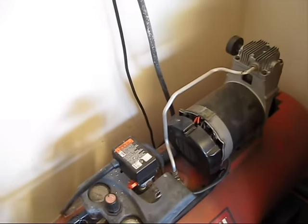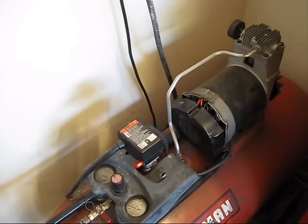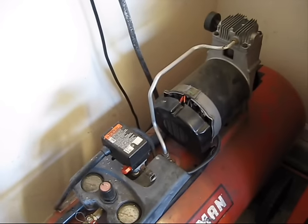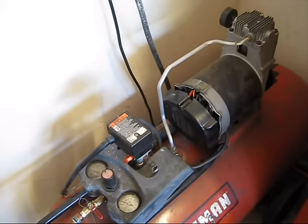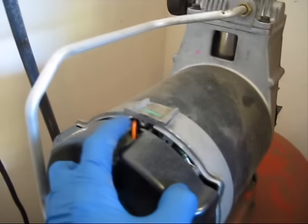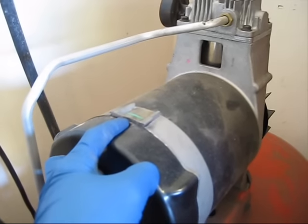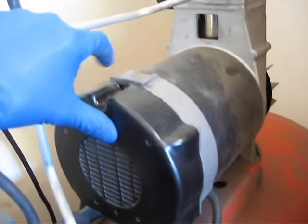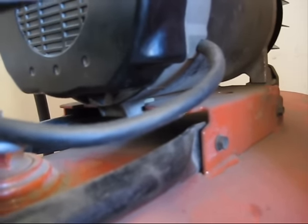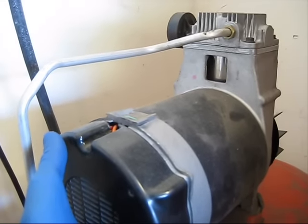The way you're looking at it is pretty close to the way I found it when I took the cover off. Originally I thought it was a check valve issue or an unloader issue, but I can hear the unloader release pressure, and it doesn't continue to release pressure, which tells me that the unloader and check valve are working. When I got the cover off, I noticed it was not sitting flush. There's a little plastic piece that's supposed to be there — it's missing right now. It goes along the top and bottom and is supposed to bolt right onto the case. It had cracked on the top and was just hanging out, and the bottom was cracked but not completely broken off. So the cover would sit crooked, and as you can see, it would not start when it was like that.